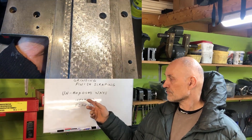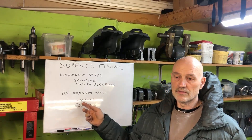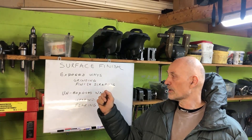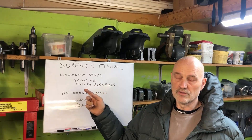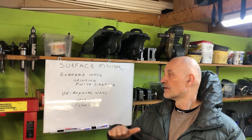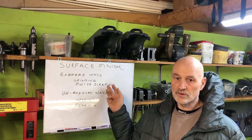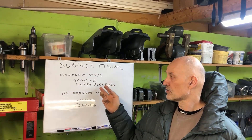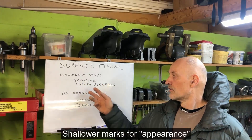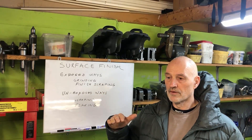On top of either scraping or grinding you could leave it with normal scraping. On the exposed ways, on top of either planing or means of straightening and flattening a piece, grinding of course would leave a nice finish. But you can also finish scrape, and also make ornamental scraping or an eye-wash effect — for example, very shallow marks with what they call frosting.